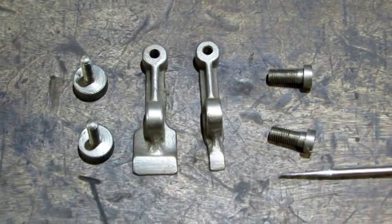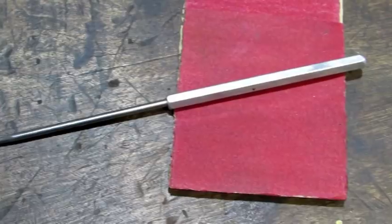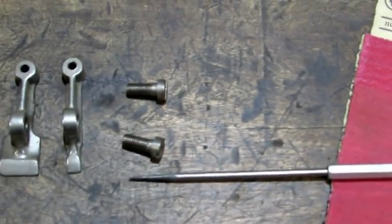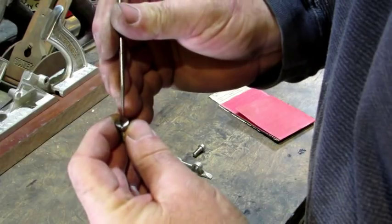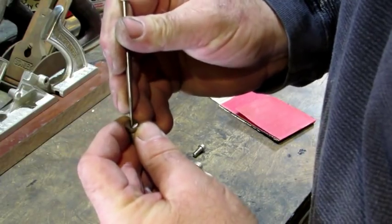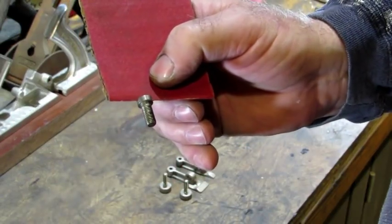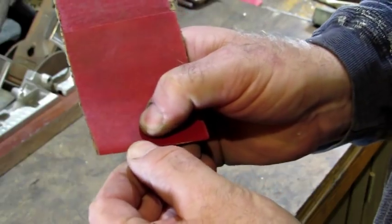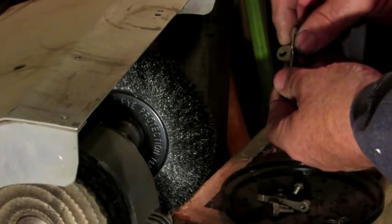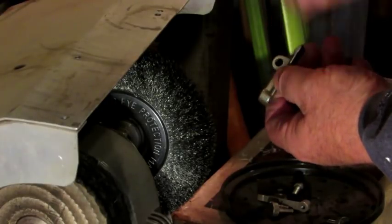Next it's on to the small parts, where I'm going to use a dental pick and some folded and layered sandpaper to clean up the screw slots, and then they're all going over to my wire wheel. Not much to do here with the dental pick — a lot of these screws will be packed full of crud. You want your sandpaper layered thick enough to fit the slot tight. On this nickel I'm primarily using the wire edges of the wheel to polish it up — it's not aggressive at all.